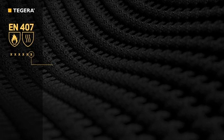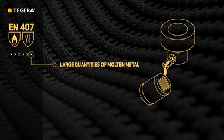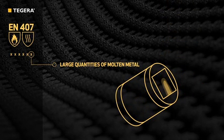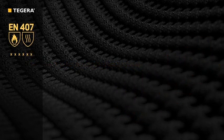The last figure indicates protection from large quantities of molten metal. Materials are tested by pouring defined quantities of molten metal onto the test specimen, which is supported at an angle to the horizon. Following the pour, damage is assessed by a visual examination of an embossed thermoplastic PVC sensor film that was placed directly behind and in contact with the specimen during the test. Innermost layers of the glove must show no signs of melting or holes, and no glove material can ignite during the test.